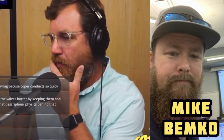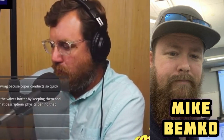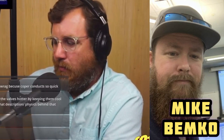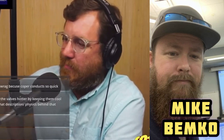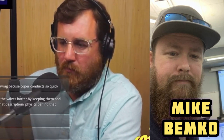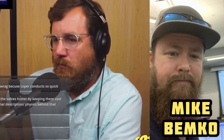Putting dryers on the outside of condensers is the way to go. I can't believe so many people are so adamant about sticking them inside — you've got to take the whole thing apart to get to it, which is annoying. That dryer is going to be going long after the unit's gone. If a unit comes with the dryer already inside I'll leave it, but if I have to open up that system, I'm cutting it out and putting a chunk of copper in its place.